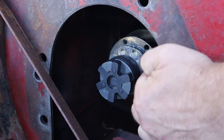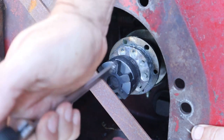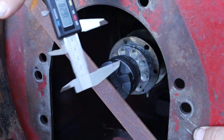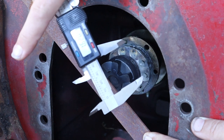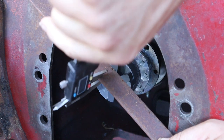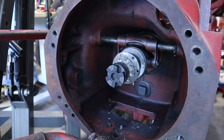Now with the coupler in place, there's still one more thing I have to do before I can start working on the motor mounting plate — I have to figure out how far away the motor needs to be spaced. What I really need to know is the distance between the face of the bell housing down to the tip of the Lovejoy connector. To figure that out I'm spanning it with a piece of flat stock, then measuring down to there and subtracting out the thickness of that flat stock. That way I know exactly how far I'm going to need to space the motor back from the face. We'll work on that motor mounting plate in the next video.